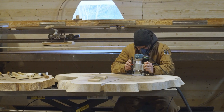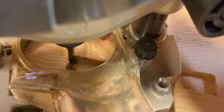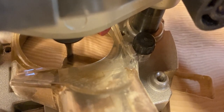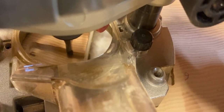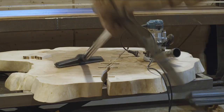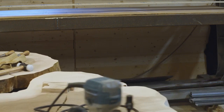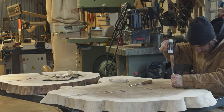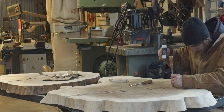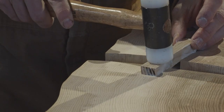I like to get about 90% of all the sanding done before I do any inlay work, and here I inlay ash bow ties using a small trim router and an up-spiral bit. I try and get as close to my knife line as I possibly can with the router bit, generally doing two or three passes depending on how thick the bow ties are — if you try to take out all the wood in one pass there is a risk of the router bit catching. The remaining waste can be easily chiseled out, and the knife line makes it very easy to perfectly align the chisel edge with the outline of the bow tie. I must have made well over 100 of these by now, and once you get a little proficient at it they can be made fairly quickly.